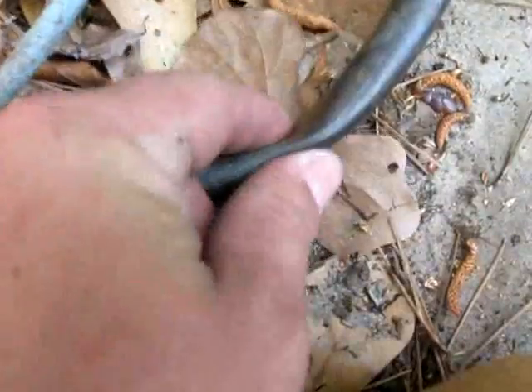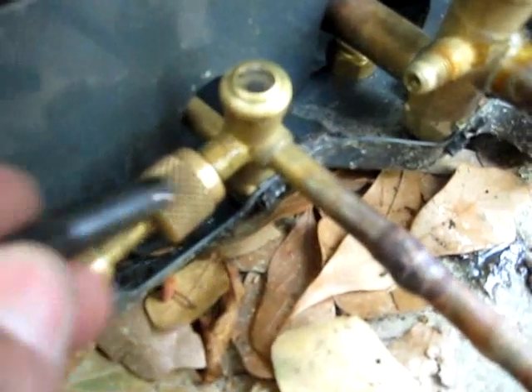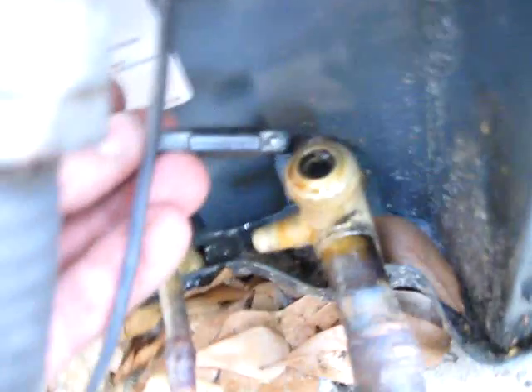We are about to pump down our Goodman here. Here's a better look at the kinked copper — the copper is kind of smushed on the side. Someone tried to bend it back into this condenser; it just didn't quite make it. And you can see — I'm going to focus in there on both these service valves — they're leaking. There's a big bubble right there, you can see it. There's a big bubble in there, and the same thing, there's bubbles forming at the top of that one.